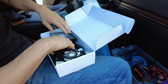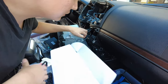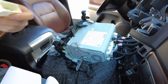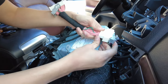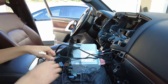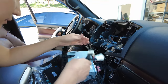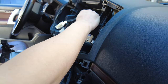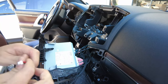In our kit you will find this main harness — it's like a big bundle of wire. Go ahead and grab this and connect it to this large connector. To remove the connector, press down on the release tab and pull up. This will connect to this and this will connect to that. We're going to route this cable over here. The other connector is going to go straight up behind here because it's going to connect to the monitor. Go back here, there's going to be some space — go up like this and it connects here. This one over here is going to go to the side and come down here.